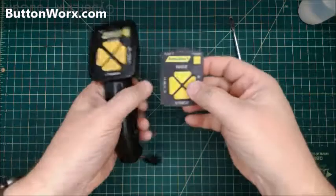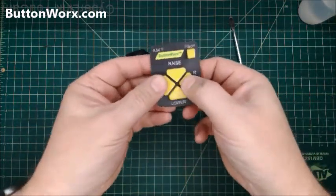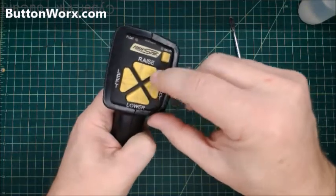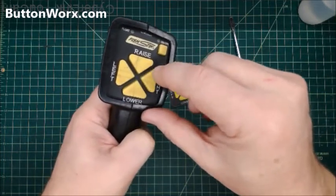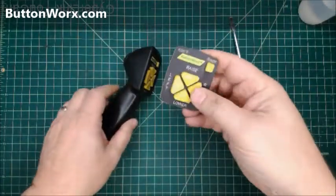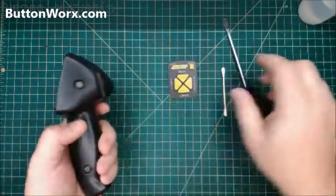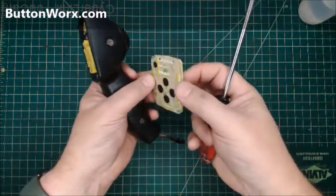This keypad is a membrane keypad with a TPU rubber cover, so the rubber is squishy. It doesn't move up and down like silicone rubber. I've heard a lot of customers say the silicone rubber rips at the seams, and I've seen that in a lot of larger buttons over time. This doesn't have any really moving parts — it just squishes, so it's soft rubber. There's a membrane keypad on the bottom and it's peel and stick.